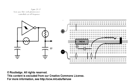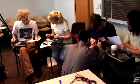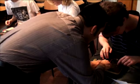Should we keep the diode in there? Yeah, I like to keep the diode in there. So take the output of the diode, and now take a photoresistor from this bus to the next one, and then a capacitor to ground. Cutoff depending on... Okay. So we need another capacitor. So try the filter.